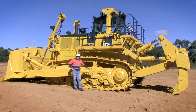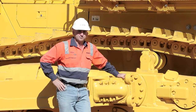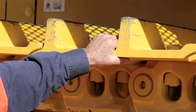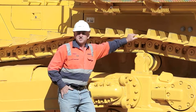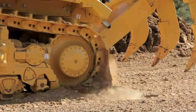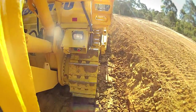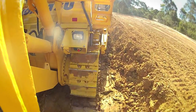Now let's talk about the ride enhancement package. Komatsu uses a low drive system. Starting with the track plates: fitted as standard are 610 millimetre extreme service shoes. If your application requires more flotation, we can offer a 710 millimetre or an 810 millimetre shoe.